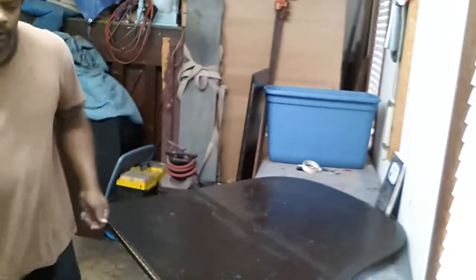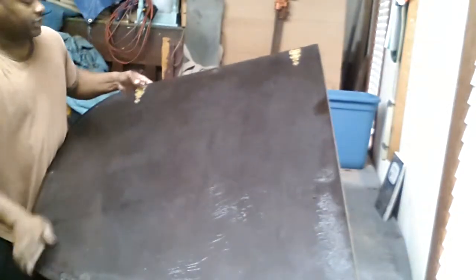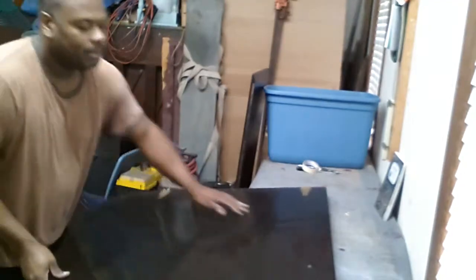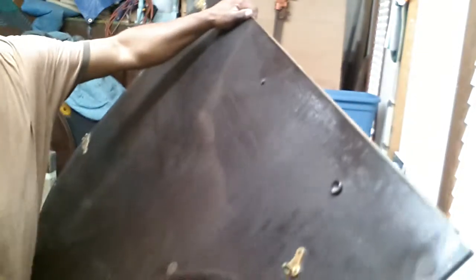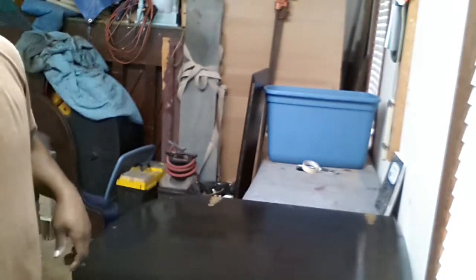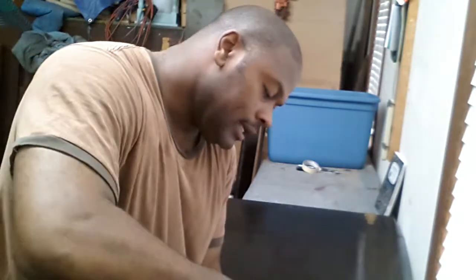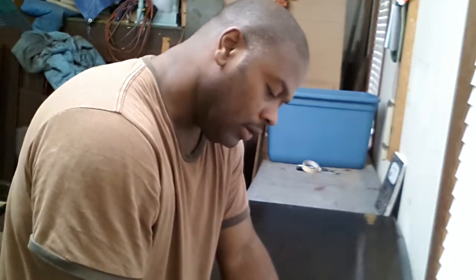And I'll get this other piece of hinge off in a second. But I'm going to show you the back side of this. We have three pieces of hardware on the back. These two pieces I've already showed you, one here and here. And then the other part of the lid catch, which is right here, this is the male piece. The female piece goes on the case, and that just allows the lid to sit in place and not move when traveling. And when you close it, it's a nice, secure close.